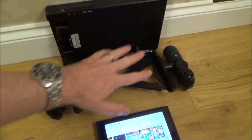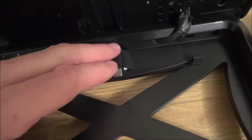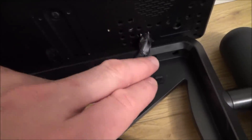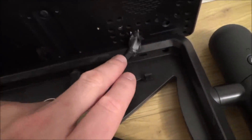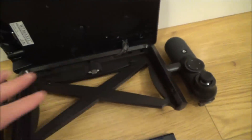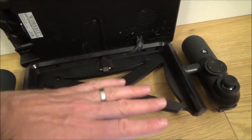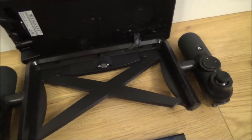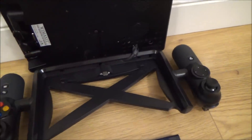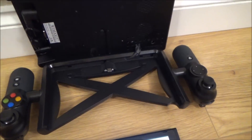Just before I glue the monitor onto the controller — if you look closely this is a USB-C port from the portable dock and it just weaves through the bottom of the controller here, goes into the hole in the back of the monitor, and I've put a bit of tape around it so it doesn't get damaged where it goes through the hole. There's also a second cable — that's the USB from the controller itself. Originally there was a little dock here for the Windows tablet, so I just had to convert that into USB, which is really easy. Just get a USB cable, chop off the plug and then follow the color code — the wires are exactly the same as standard USB: red to red, black to black etc.